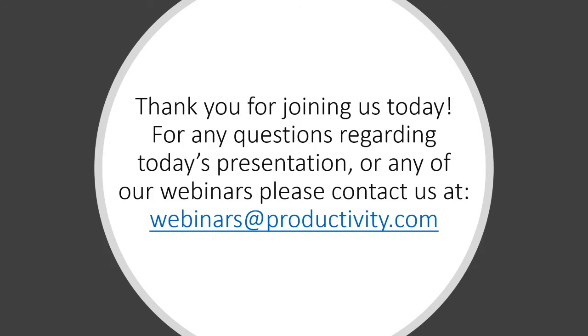So I'm not sure I understood all of that, but there is a technique that I'd like to use as far as how far down do you go. If I'm at risk of hitting something else like the vise, then I start by positioning the probe above that surface I'm wanting to avoid, but in a place where it would do the probing as I wanted, and then zero out the user coordinates for Z, and then move it back up and see where I position it at that point. Is it a half inch? Is it an inch? What is that value that I get?